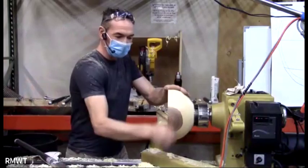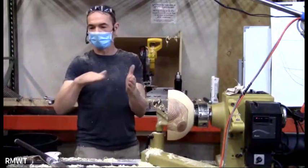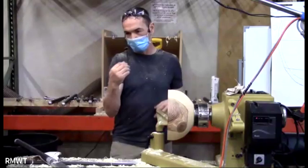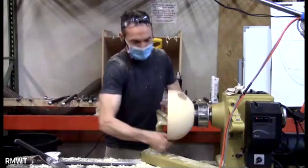And that burr cuts it. Now, when you're on side grain, it's technically scraping a little bit more. It's not relying so much on the burr on the side grain. You could still use a sharp chisel because it's just side grain, but it's using the burr up here. So it makes powder on the sidewall, and it'll make little bits of shavings on the bottom, because on the shavings, it's technically scraping like a skew on its side. It doesn't dull as quick, but on the end grain, it's definitely doing a form of abrasion.